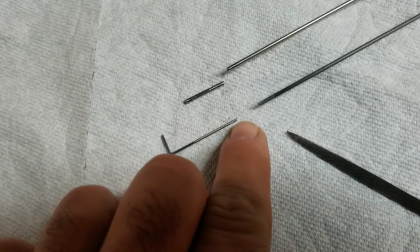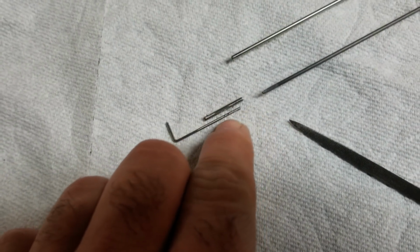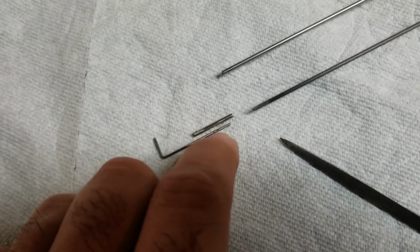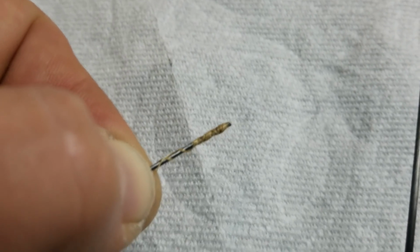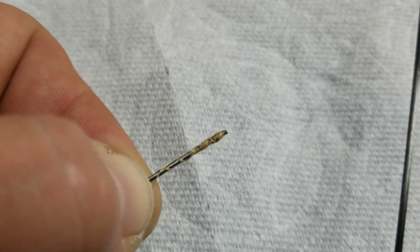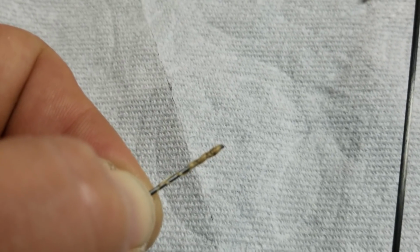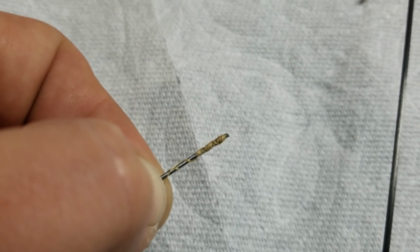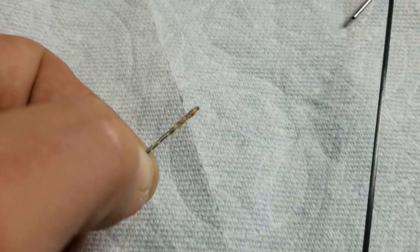And to tighten up the fit of this part into this coupler, I'm going to wrap a little bit of Kevlar thread around this before I slip it in. So I'll get on with assembling all this stuff. Okay, I've wrapped the end of the elbe in some Kevlar thread really tightly to take up some of the slack, and I'm going to simply saturate it with some super glue or CA glue and slip it into the other end of the coupler.